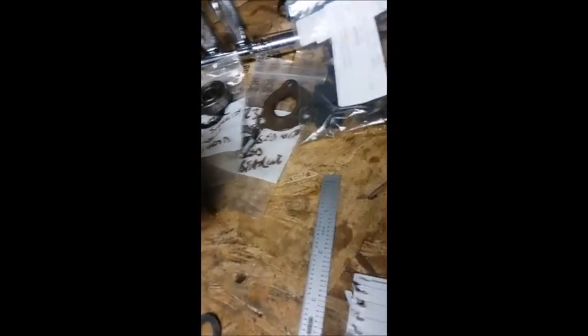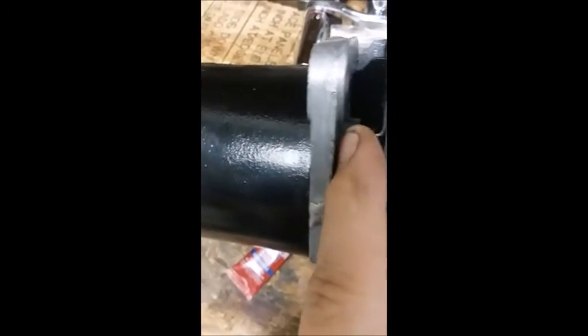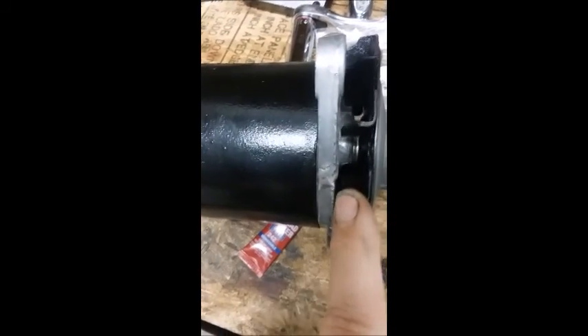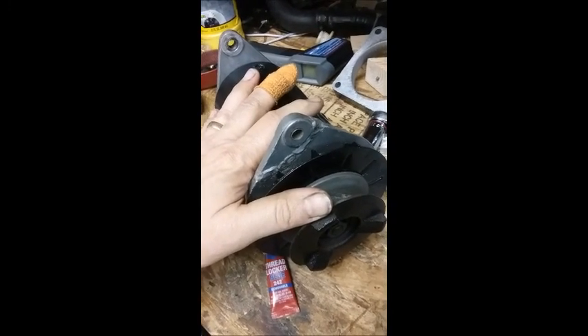This generator has been worked on before — you may have noticed in the other video there's a weld going right across here. I actually had to grind that away a little bit because the fan wasn't quite clearing. I had straightened the fan up when I painted it, and it actually ground on the housing. Anyway, I wanted to document those things, and the other thing I need to do now is repolarize it according to the directions before I install it.